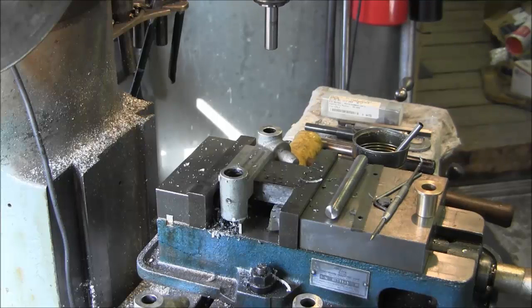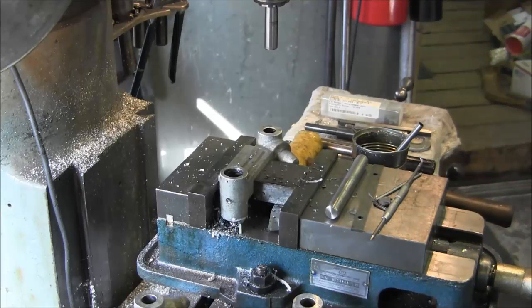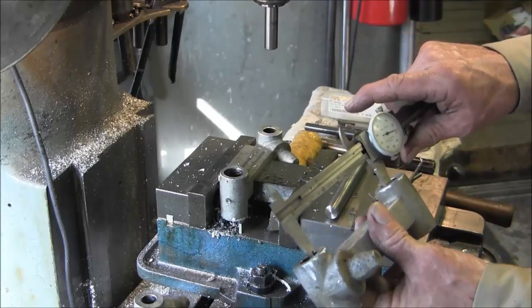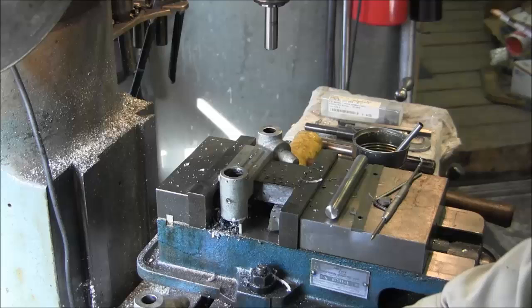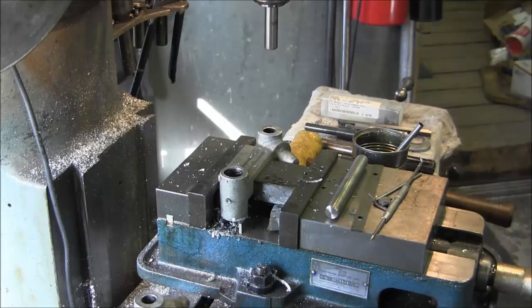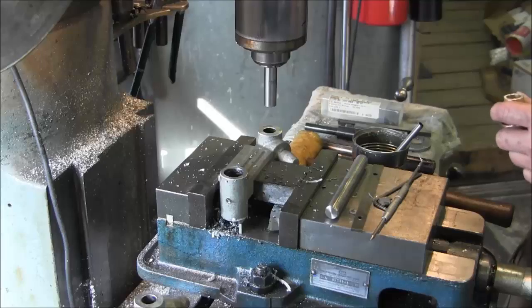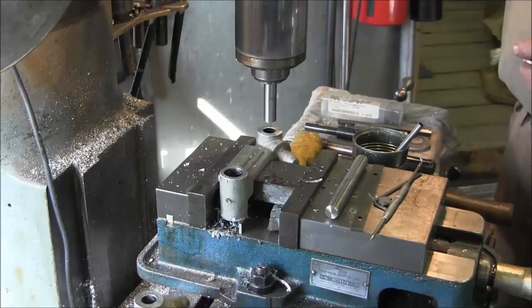Okay, let me see if I can do this real quick, because I was getting in a pissing contest with myself. All day long I measure four, which is say 4 inches. It's 420, but I put the math together: 4 inches plus half one of the holes, which is 5/8. It's 4 5/8 all day long, and actually with the extra, it was 4,650 center to center on every one of those. So I was wondering why I'm not getting that, and if I put my 4,650 into the readout here, I would be way off the map.